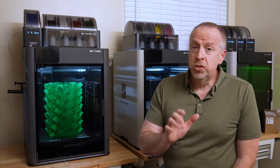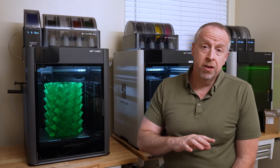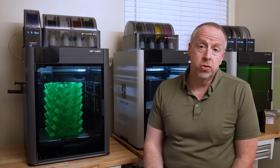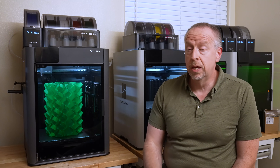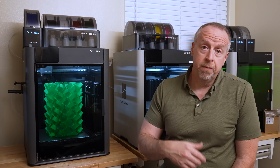It only purged each nozzle once, so there's less than a gram of actual poop. To be fair, I did do this test with an early beta of the slicer and early print profiles. If I re-slice this today with the latest software, the tower is down to only 135 grams — considerably less than the 190 from my print. I will reprint and confirm that before I publish my full review.